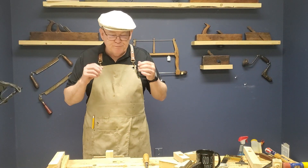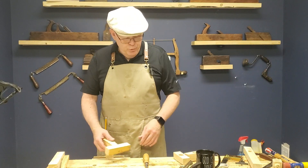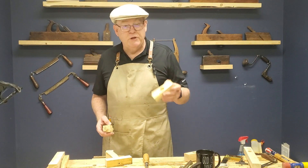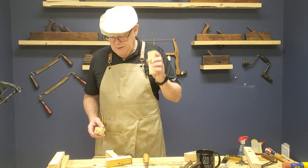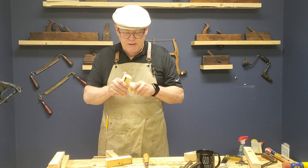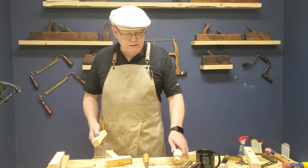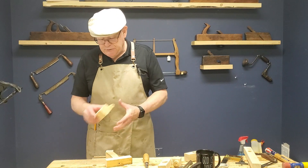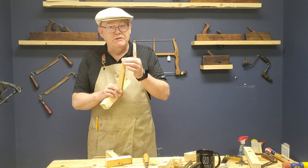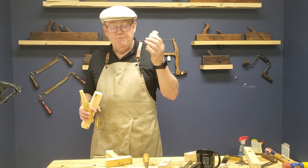What is a pegging joint? A pegging joint is used primarily with square stock where you put a round tenon on one end and you will drill a mortise with an auger bit in the other end. The two go together just like that — a nice tight fit. If you have ever looked at old stair balusters coming out of a house being remodeled, you will notice that there are often round tenons at the top of those. That is a good application.